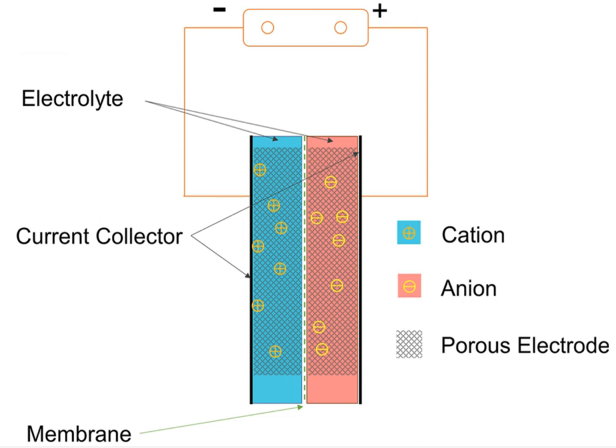Hybrid capacitors, such as the lithium-ion capacitor, use electrodes with differing characteristics, one exhibiting mostly electrostatic capacitance and the other mostly electrochemical capacitance. The electrolyte forms an ionic conductive connection between the two electrodes, which distinguishes them from conventional electrolytic capacitors, where a dielectric layer always exists, and the so-called electrolyte, e.g., manganese dioxide or conducting polymer, is in fact part of the second electrode, the cathode, or more correctly the positive electrode. Supercapacitors are polarized by design with asymmetric electrodes, or, for symmetric electrodes, by a potential applied during manufacture.